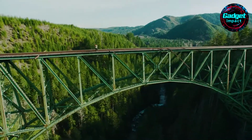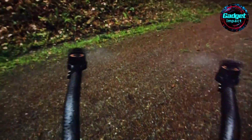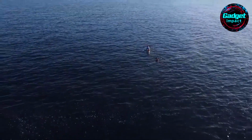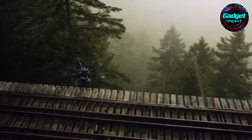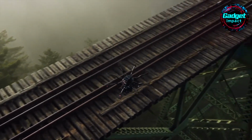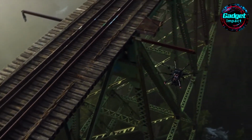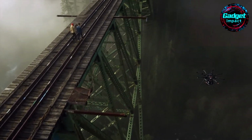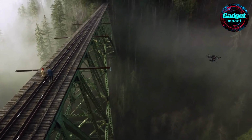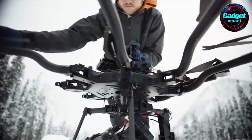and monitoring capabilities, accessing flight pack voltage, satellite count, flight mode, attitude, checklists, vibration levels, height, and temperature. The drone's folding frame reduces its size by 50% for easy transport, while a vibration isolation system mitigates high-frequency disturbances, enhancing image stability. Its weather-resistant enclosed design protects sensitive components, and enclosed receiver bays protect receivers from environmental damage. Custom-tuned sinusoidal motor drives provide optimal speed, reliability, and quiet operation.